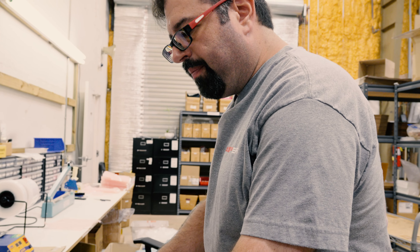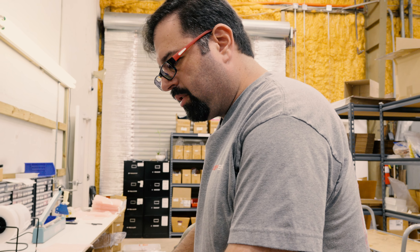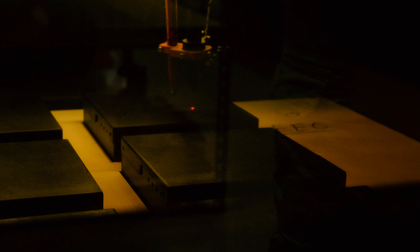What we're doing is allowing the machine to set its own distance from the laser — it's a focus. This machine does an autofocus by bringing the work surface up until it touches a little tip next to the laser, and once it detects contact, it drops down to the correct height. Now we're bringing the laser back to its home position.